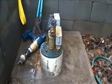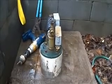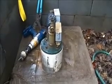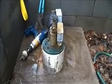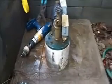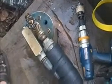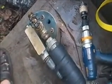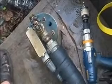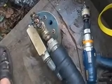So I'm going to pull the well up about 3 inches. The piping and everything on the pull is about 3 inches. Then I'm going to put a board under the threaded hole and try to drill through it with the 2-inch hole saw you see there, without all the junk falling down in the well. Right now I'm going to break this pipe coupling, separate it, so I can pull the piping and stuff up out of the well without breaking everything off. I'm going to try not to worry with the electrical. I may have to undo that also.